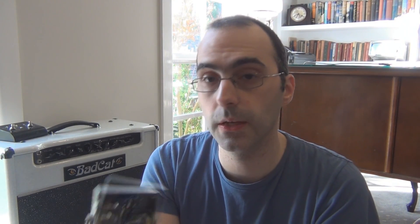I just thought this was a perfect opportunity because all I really had to do was tap into the input, output, plus, and ground — that's all you really do to build one of these. You basically wire up a pedal without an effect inside, and where you would usually connect plus, ground, input, and output, you just put an alligator clip on the end as a temporary way of connecting to your effect outside the box. It's very easy to put together, and you'll want to build one if you plan on doing more than one or two builds, particularly with builds you have a lot of problems with — you don't need to add another source of unreliability.